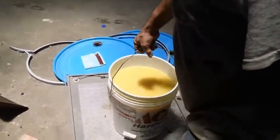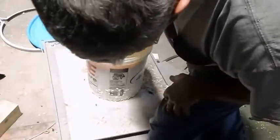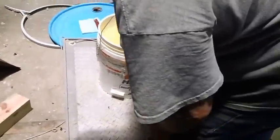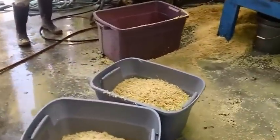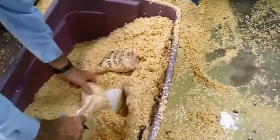This was a minute and 45 seconds worth of pressed liquor. 39.1 gross, minus 1.8 tare — we've weighed this style of pail a bunch of times and it's 1.8. So gross was 39.1. In the purple tub from the same time period is the pressed cake that was collected.